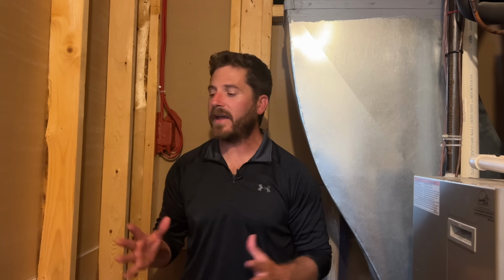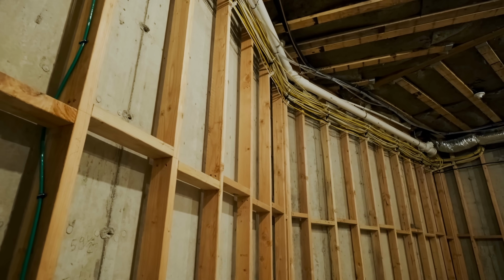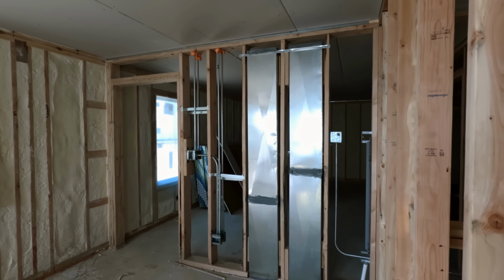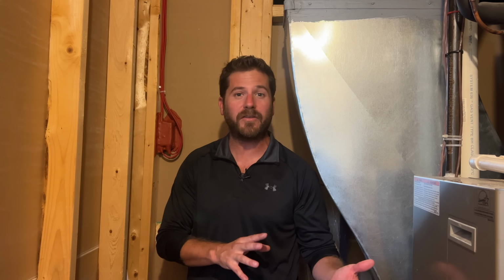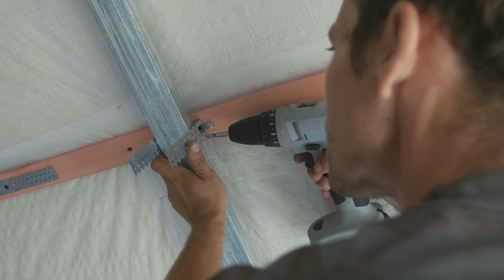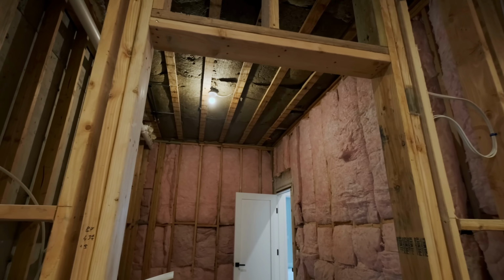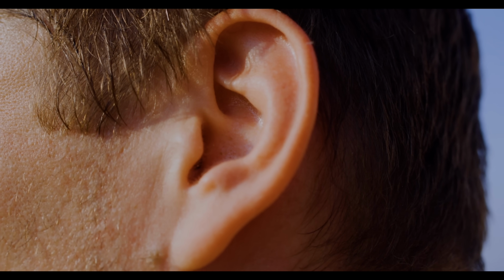But before adding that insulation, here's a couple of things that a lot of people don't really talk about and that can stop a few more decibels from coming from room to room. Because if everything that you do in terms of soundproofing this wall is just to reduce 1, 2, 3 decibels each, then it starts to matter, because if you get to 10 decibels, it's basically the equivalent of cutting the noise in half by what a human ear can hear. And all those decibels count.